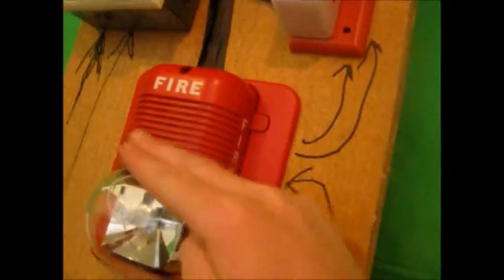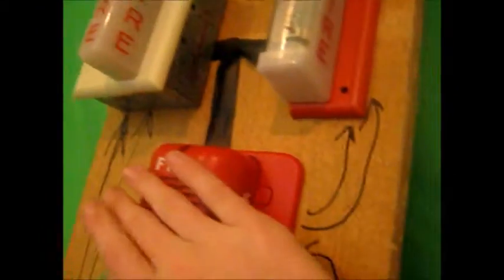This is going to be a continuous system, though, because it is wired through 2-wire for everything. And this is the only horn that's on. This is set on horn strobe right now, on continuous, remote strobe, and the horn on this is not hooked up. These are acting as remote strobe, and this is acting as the horn strobe for today.